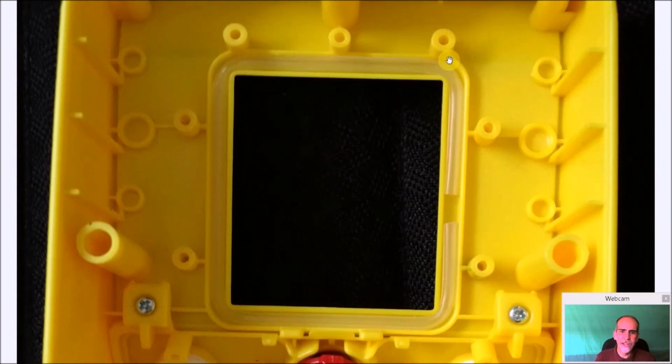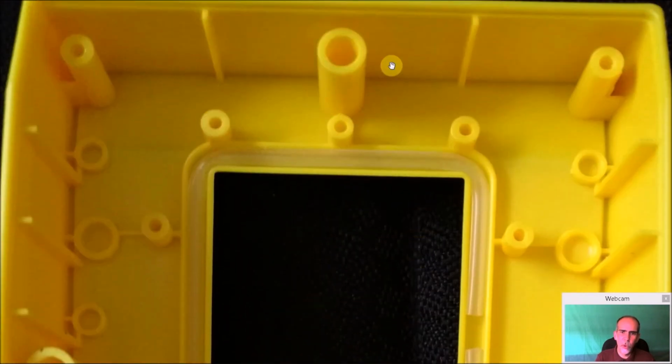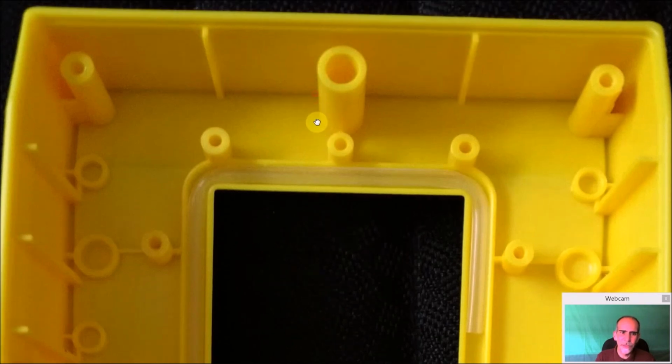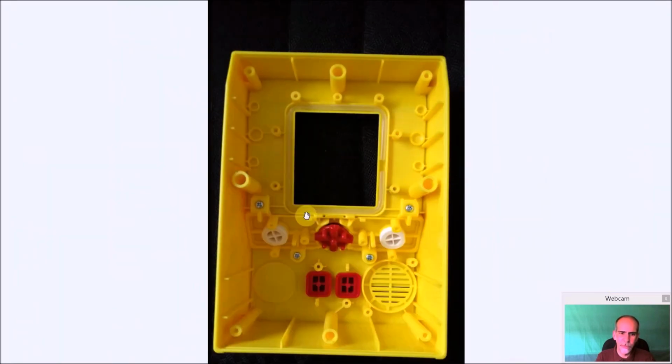The other thing I had to file down was this guy, which had to be filed smooth to the level of this lip. This had to be filed to this lip. This had to be filed to this lip. And this guy as well. Because the screens would come up all the way up here. Also, this has to be filed off. This has to be filed off. And in addition to them being filed off, I used a grinding tool. This is pretty, I don't say super thick, but it's thick enough that I had to do it to get the screen in here. You'll see a little bit more later when I get to the actual screen as to what I'm talking about. But you can't put the screen in as it is. It's not going to fit this way, and it's going to come down to the joystick area and not fit. So we'll get to that when we get to installing the display.